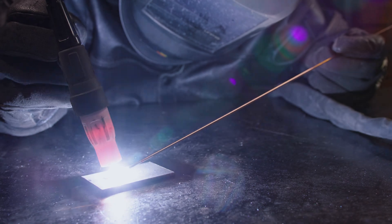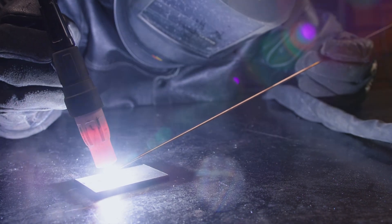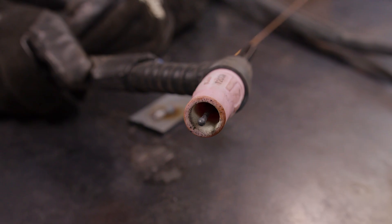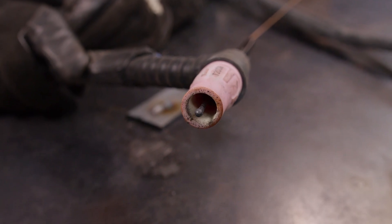The second way to dip your tungsten is by touching your filler rod directly onto it. Instead of the rod melting into your weld pool, it is now coating the outside of your electrode. This causes instant contamination of your tungsten, and a lot of the time it will cause the arc to wander. Long-term constant use of the same tungsten will also naturally build up contaminants, like discolouration from the gas and oxidisation, even if you're cleaning it regularly.